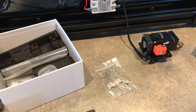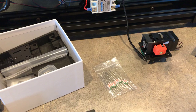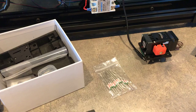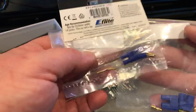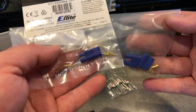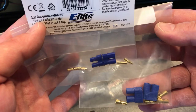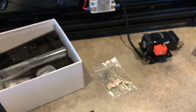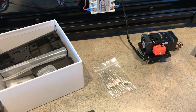On this printer the bed is fairly easy to remove, so I wanted a good set of plugs that I could connect and disconnect whenever I need to pull the bed off. I ended up going with RC car battery connectors — the larger one is for high voltage and the smaller one is for the thermistor wires. These are really good quality connectors meant to be moved around and shaken, which is exactly what I wanted instead of a stationary connector.